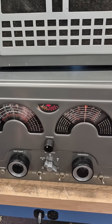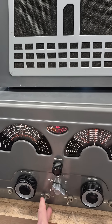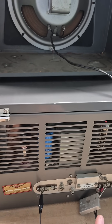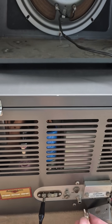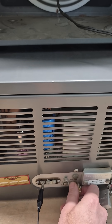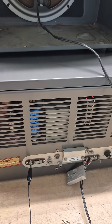We'll test the standby system. The front standby switch performs the same function — that has not been interrupted. Let's go around the back. Now, instead of using those hazardous standby terminals, you have an RCA jack. When you short this, it mutes the receiver. You could hook this to a Dow-Key or some other switching method to mute your receiver.